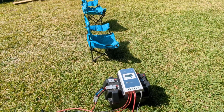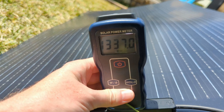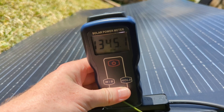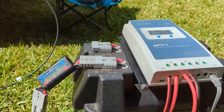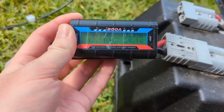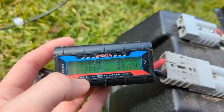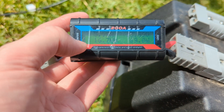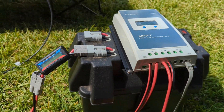Let's get this set up and have a look at a few other specs once the panel is in place. Looking at the power meter, we're getting over 1350 watts per square metre — far in excess of the 1000 W/m² used for standard test conditions. With a cloud just passing over, we can see 180 watts maximum output and a peak of 13.3 amps coming into the battery from a single panel.